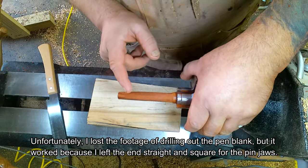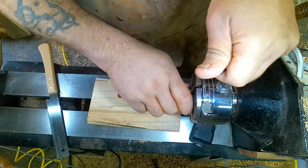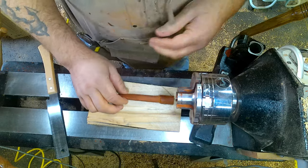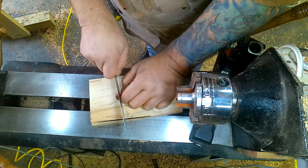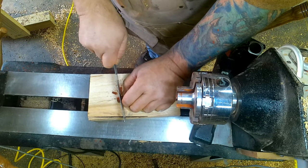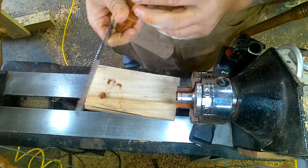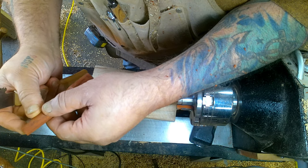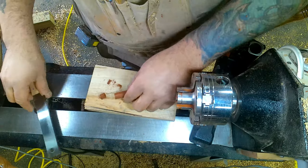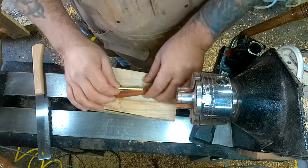So again, I need to lose that much. I'm going to use my little pull saw here. I'm going to leave a little extra because I'm going to sand back the rest to make it even on the end. There's that crack. We're not exactly perfectly centered — remember, we had that crack so I had to move it a little. It's not perfectly centered. That's something I will work on. That's why we experiment. Establish a process and then improve the process.